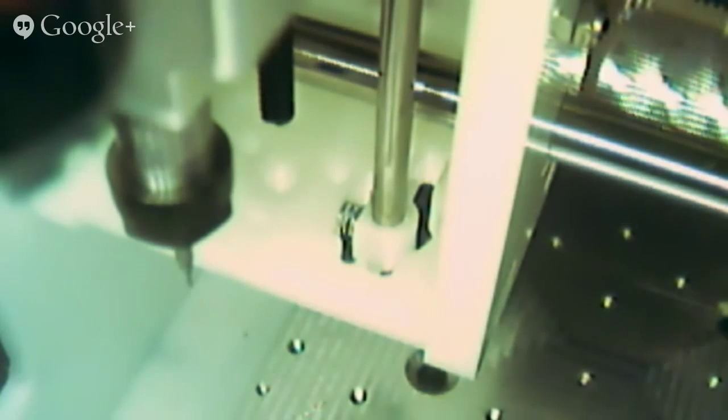Yeah. So, the way that was actually doing it, I think Malcolm said, it's actually getting conductivity to the bed. Exactly. That's a really cool way to do it. So it just goes really, really slow, until it touches it, and the minute it touches it, it says, okay, there I am. So all the tools have to basically be conductive material. But most tools are.